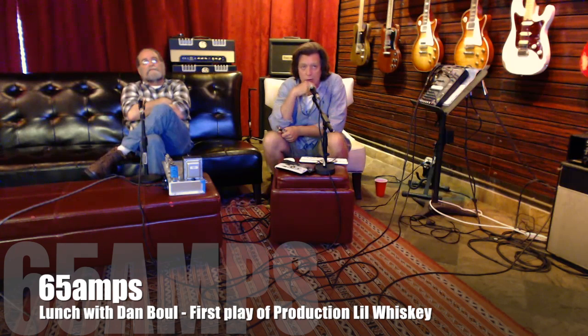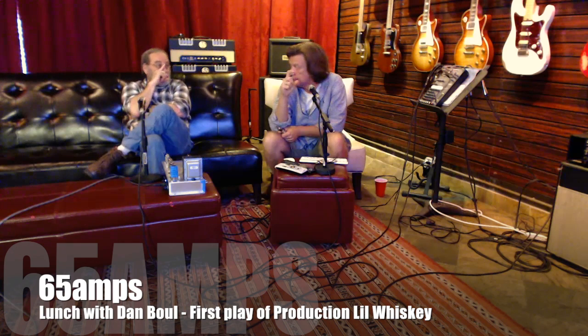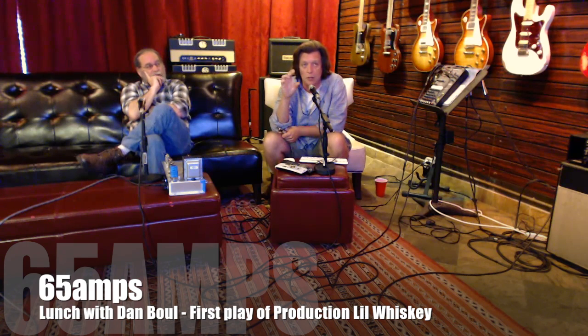Dave G, modern 12AX7 recommendation. What kind of amp are you going into? That really matters. It's also a lot of personal preference. Is it a high gain amp, low gain amp, multi-gain stage, simple amp? Oh, Little Elvis in London. Okay, well, for those, the Tungsol 12AX7 is great for the phase inverter. I still like, in those amps, the long plate. There's only two that are available now in the modern world: the JJ ECC803S, where the 0 in the middle of the numbers means it's their high grade. So instead of ECC83, which is a 12AX7, the 803.